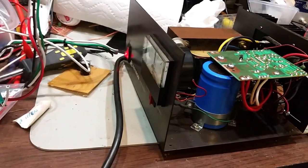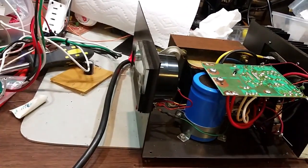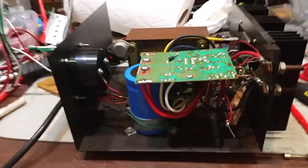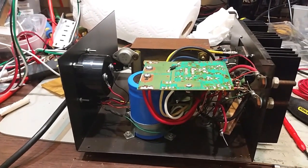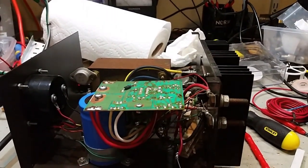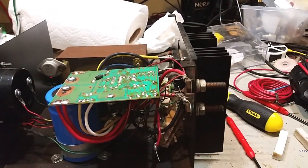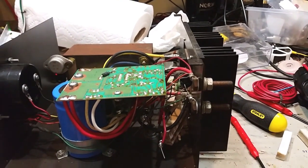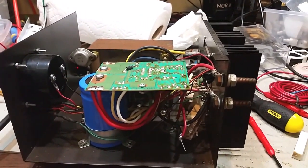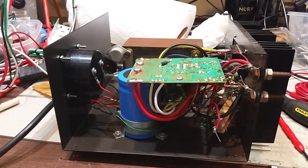This is one of those Murphy's Law situations where someone using the wrong fuse caused the problem to get a lot more interesting than it would have been otherwise. If you're watching this because you have an Astron with a problem: one of the first things I did after confirming good transistors was pull the purple wire that triggers the crowbar. That stopped it from shorting the output. You obviously don't do that with a load connected, but at that point you can see the output voltage and start troubleshooting instead of having the crowbar short across the output.